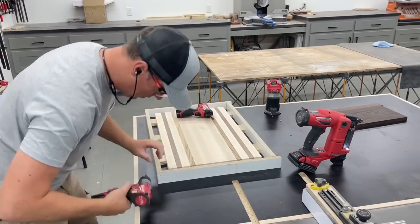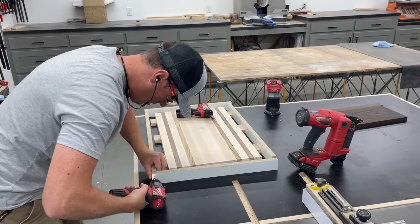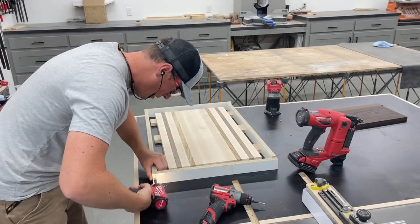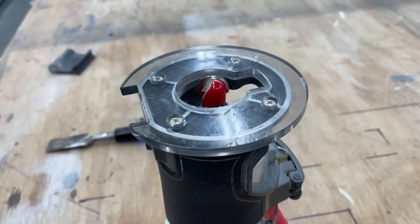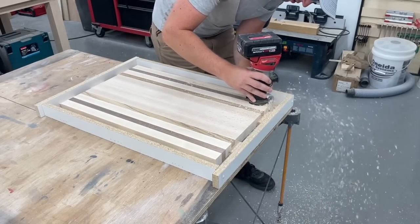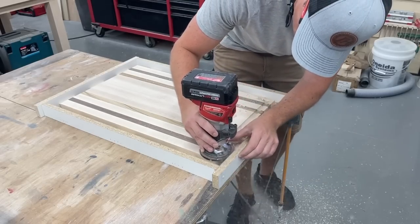On this one I wanted to add a juice groove around the whole thing, so I first needed to make a jig — simply a frame around the board that I can run my router along with a Freud three-quarter-inch round-nose bit to make the groove. I know a lot of people who make cutting boards as a business, and the only way to be efficient making multiples is with jigs like this. I'm not planning on making more of these, so this is just a quick and dirty one thrown together.